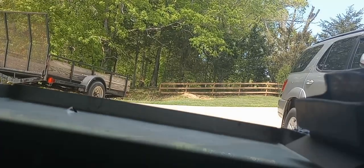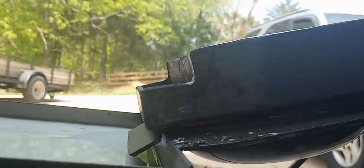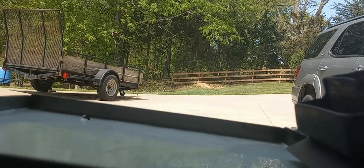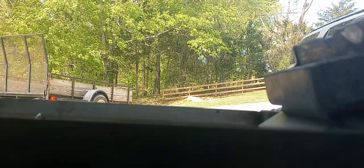Let's see. Now this pot, I've drilled it to make number fives. I've never made fives before, so who knows what's going to happen here? It may not run a lick. It may run perfect. I have no clue. But I've set the distance down a little further on the ramp up to the pot to give the shot a little bit more room to drop, because if it's too close, it'll turn into a steady stream, and then you shut her down and you're done.